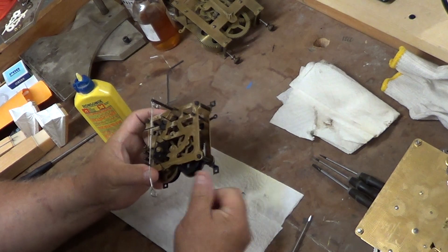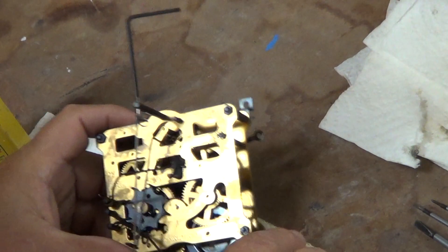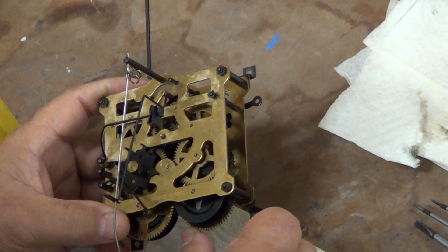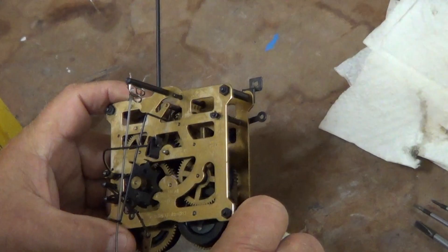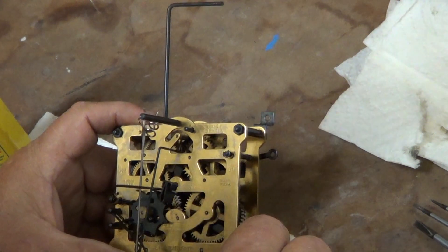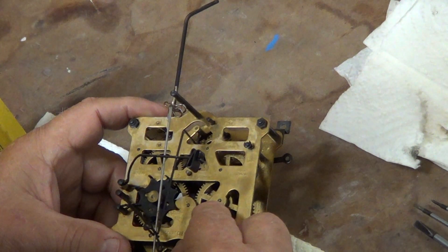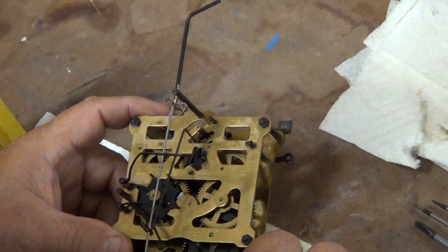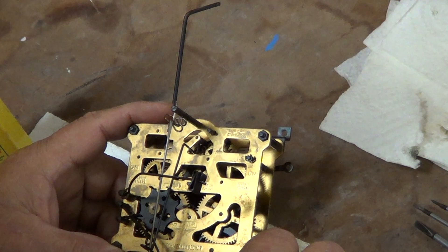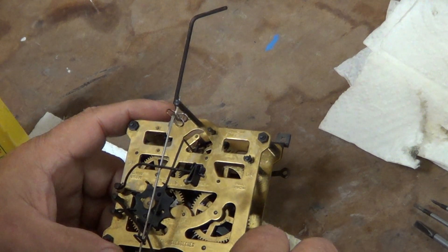What we want to do is put our finger right here and wobble that — putting back and forward pressure on this. We want to watch these pivots and make sure they don't move very far. You can see how much those are bouncing, especially this one right here. This pivot is moving about one times the thickness of the actual pivot itself — I call it bouncing around. This would probably run and you might get away with putting real oil in it, but it's really getting worn and that's what we're watching for.